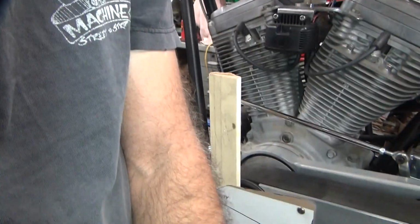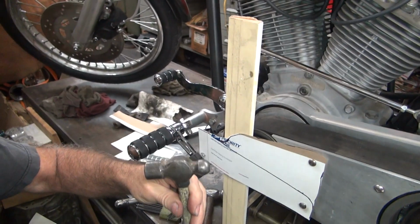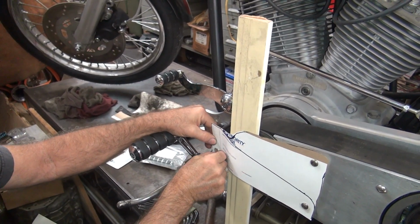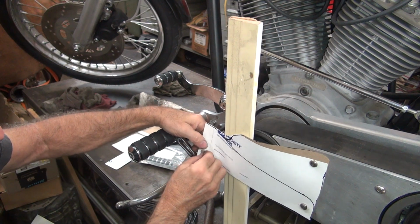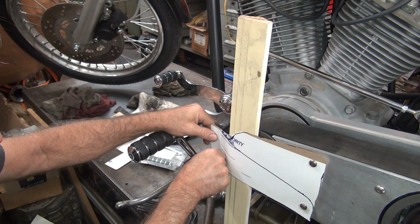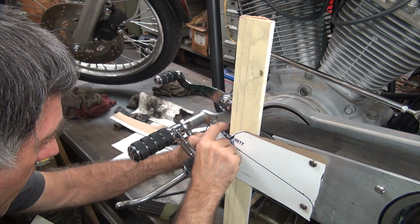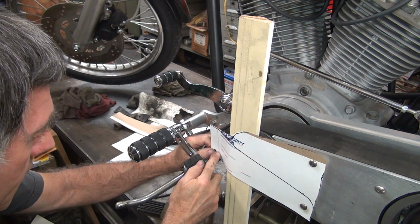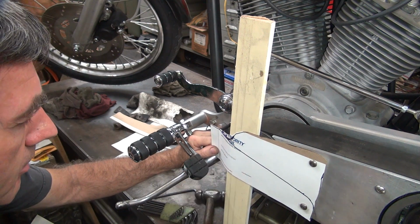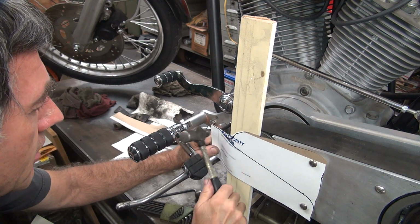So it's just like making a gasket, same process. We're using the ball peen right here to beat on the edge, and you see how it cuts the hole there pretty nicely. So, a couple layers here. Boom, there's a hole right there. So now you just line that hole up. Make sure you're about in the same identical spot. It's kind of hard to tell exactly where you're at, but you're pretty close. Now you go up to the top one and do the same thing on the top. Flip over the ball to cut it.